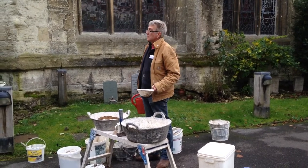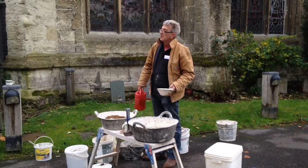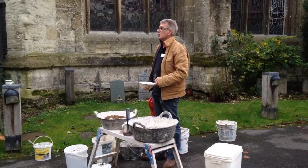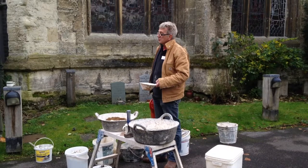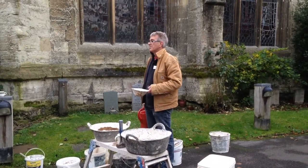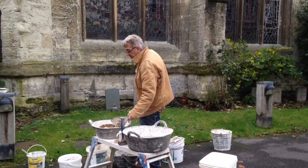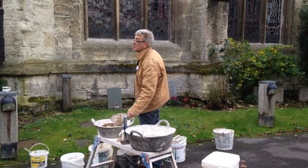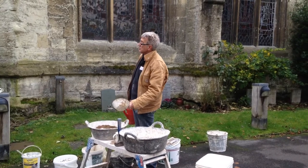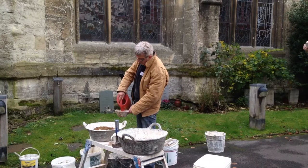The other thing they all say is that you must give it all the water it needs in one go, or constantly from sprinkling. What you mustn't do is give it half the water, and then when it's really slaking, give it another batch of water — because you chill the lime. What that means is you get loads of little lumps that will never mix in, and it makes your lime mortar too short — not enough active binder.